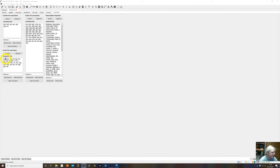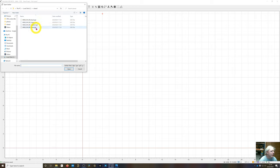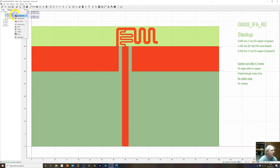In the Utilities tab, I delete some extension entries so that the DeskCNC software — which uses a .dnc extension — will automatically save with that extension when exporting G-code. I then open the Gerber files: these are the four files exported from Microwave Office. The notes file isn't really needed but I import it anyway. It imported at 80 millimeters wide by approximately 48 millimeters tall. I change the layer colors to match Altium's scheme: copper 2 is blue, top copper is red, and the board outline is yellow.